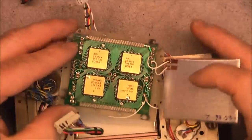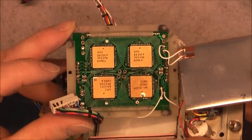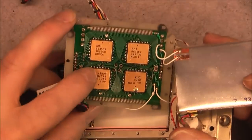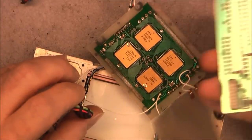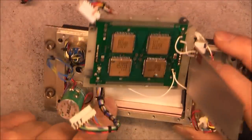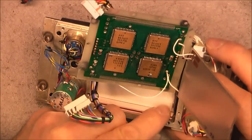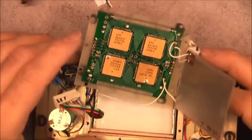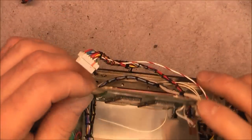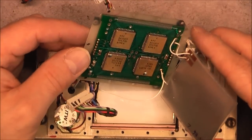And look at this here, I did not see this. Very beautiful gold ceramic ICs, probably LCD controllers, with surface mount capacitors here. Also, yes, we have some of the same on the other boards. One weird thing is the use of what seems to be very regular and cheap zebra strips here, and not even golden contacts here. So I guess it is why we have a number of screws all around to secure the zebra strips, but it is not really impressive, this thing.